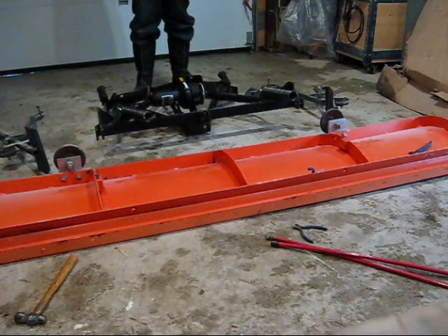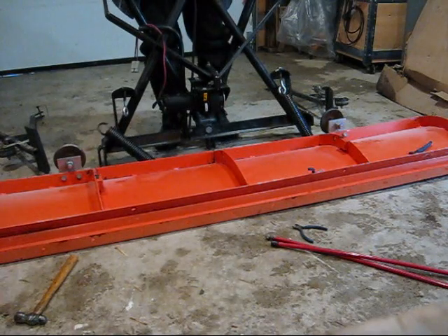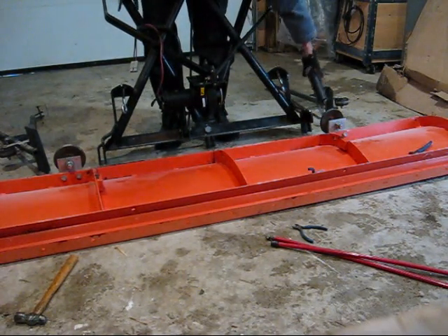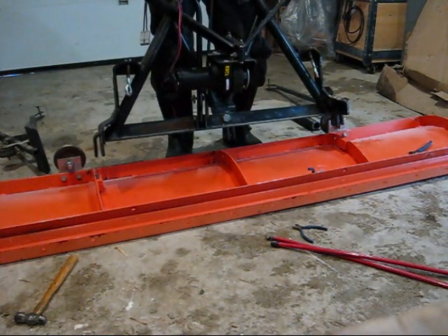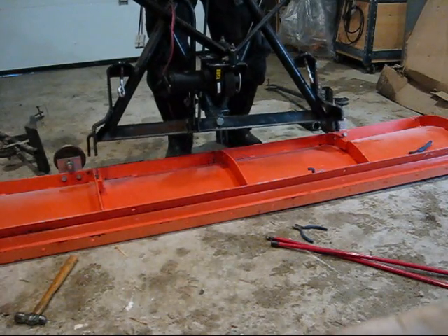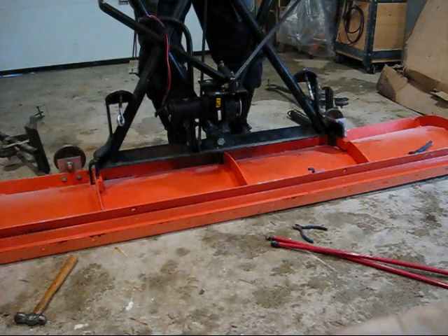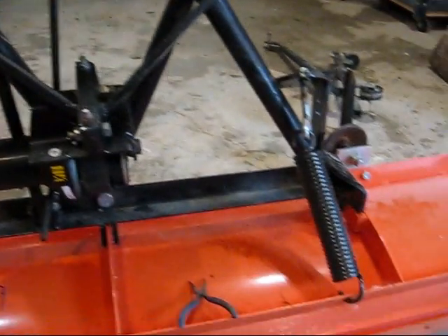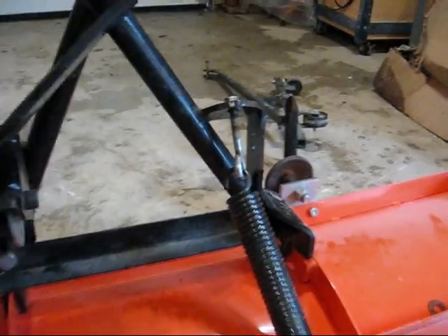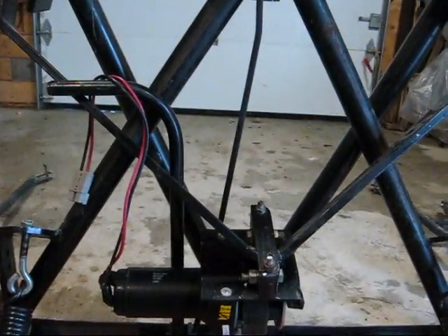So I'm just going to put this together now and show you how it goes. With everything on the floor, I lift this up — it's about a hundred pounds — take off the springs, lay the slots on over the holes like that, and then put in the pins to hold it in place. With the bracket in the upright position, I put the two springs on. They just go on an eye bolt and loop into the plow, one on either side, to stop it from tipping back.